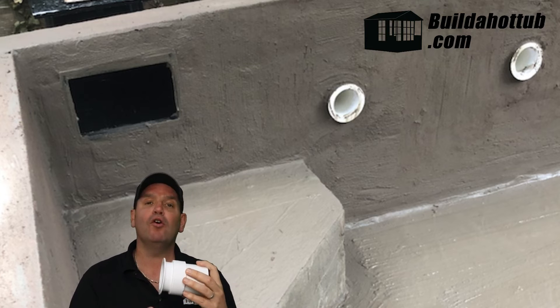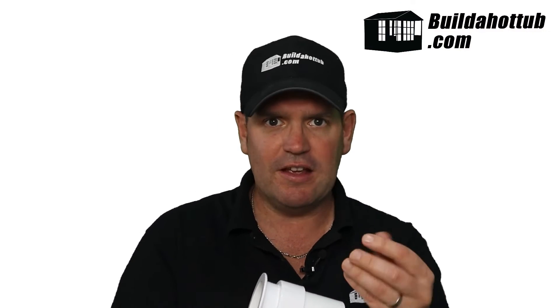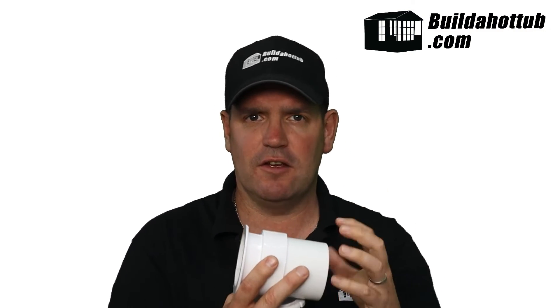If you're not sure, you can use an epoxy stick — something like a Genolite or a JB Weld. They do nice putties that you can mold and force around the edges to make sure they seal. Things like PC-11 are also popular; it's not a favourite of mine because I find it a little messy, but it does the job and is readily available. Make sure you're sealed all the way around here before you do your tiling. Your tiles, grout, and tile adhesive should be the very last thing sealing up around these.